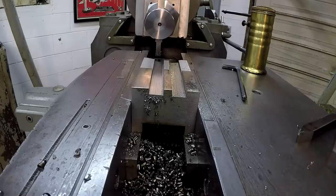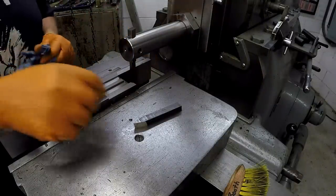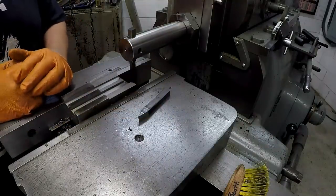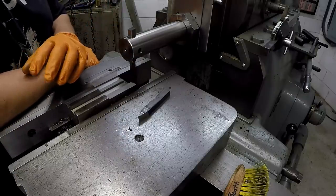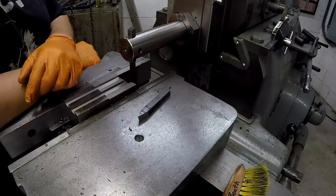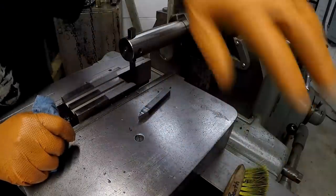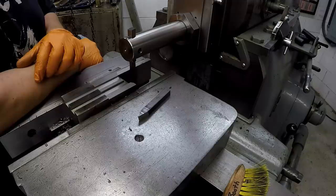The more that I practice this stuff, the more feel I have and the more experience I get, so that I can actually utilize these practice cuts with real jobs and real techniques for other projects. I'm happy with the results I'm getting now, and thanks a lot Bill and Dana for helping me with tips on the tools and how you guys use your shaper. From here I'm going to break this setup down and set up the other big Kurt vise on the side of the table. I need to rotate it around to work on the coupling I have — I can't position it in this vise and have reach for the bar. If I try to swing this around, the screw hits the ways. Anyway, that's going to be the next project.